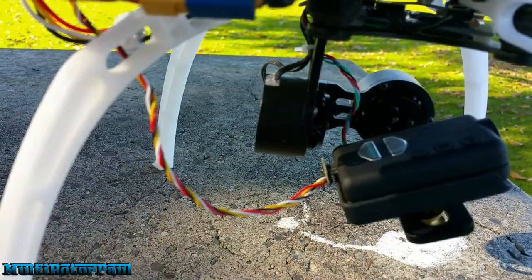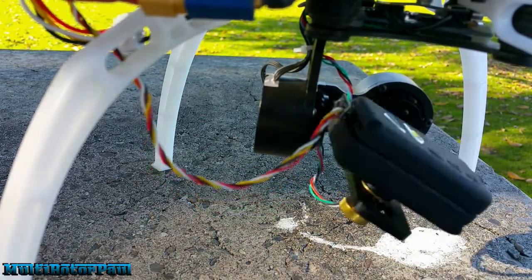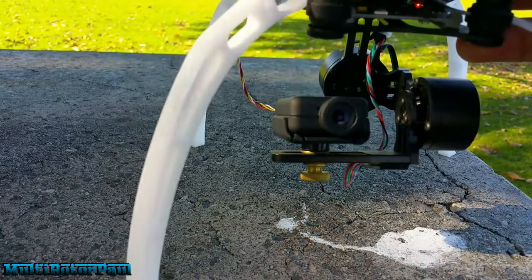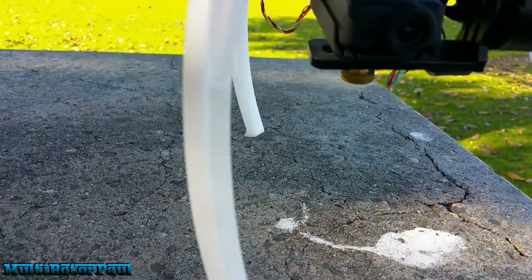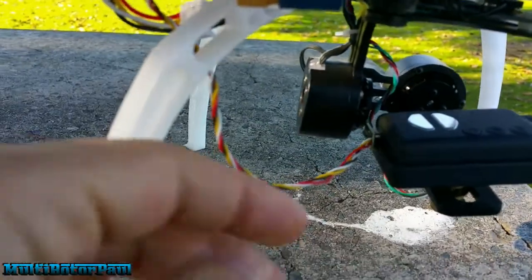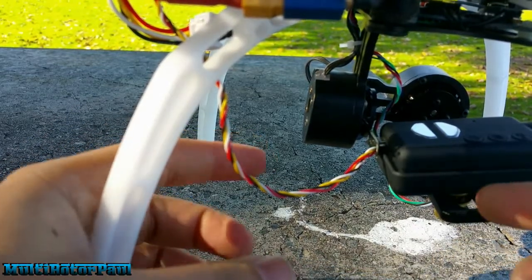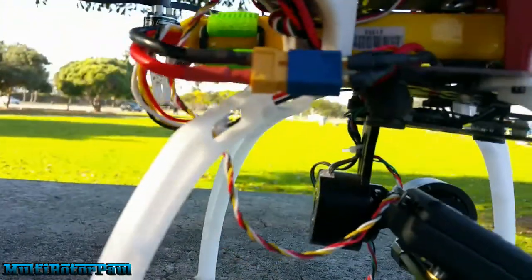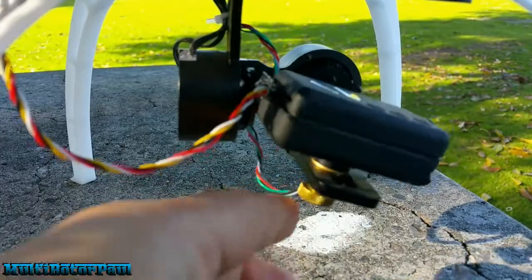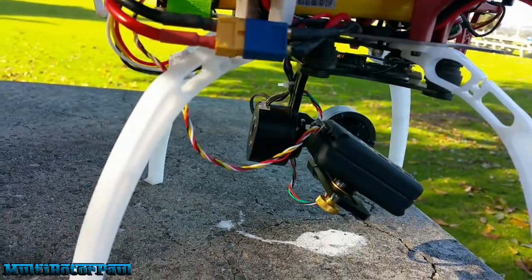It's extremely flexible — it's the video-out cable, and the one that comes with the Mobius is pretty bad if you're going to use it for a gimbal. This one has no protective cover on it, so it allows very easy operation and rotation of the gimbal. The stock cable sticks way out the back and when you rotate the gimbal downward, that cable hits the bottom plate of the quad, causing the gimbal to shake because it can't hold position. You get terrible video quality when this happens, so it was time for a change.